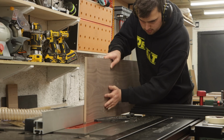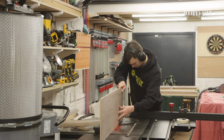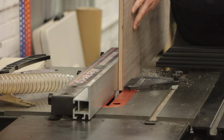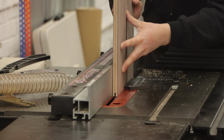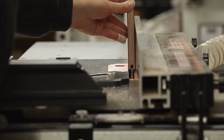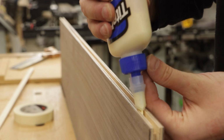To cut the groove, I used a CMT 5mm grooving blade. The width of this blade is only 150mm, and my table saw takes blades up to 250mm. But that isn't an issue because I'm never cutting grooves that large, and even a 150mm blade can fit in the table saw. You just need to raise the blade enough to peek through the table.